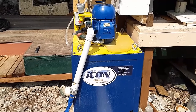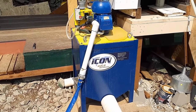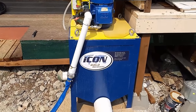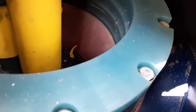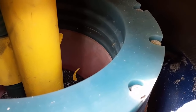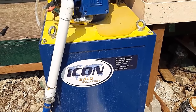But how does it all work? Before I break down all the components, let's talk about centrifugal concentrators in general. They are gravity concentrators or high gravity concentrators. What they do is spin up the drum inside really fast — there's the drum right there — and create a centrifuge. The centrifuge forces the process material that's going through it against the outside edge of the drum really hard. In the Icon I-150's case, it's about 150 times regular gravity that it's being pushed against that outer drum.